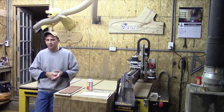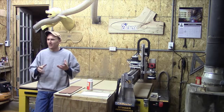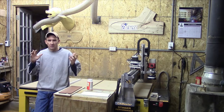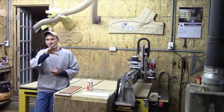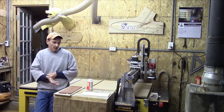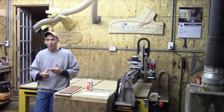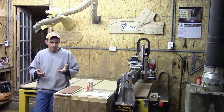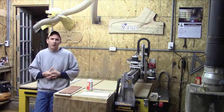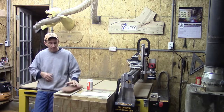The programs I've cut for you — we're going to give you samples — were basically in the holiday Christmas package and the holiday ornaments. There are 8 ornaments nested on one piece of material. I've drawn a single ornament out of that entire nested sheet, one at a time. The job requires two mills: you need a quarter inch end mill and an eighth inch end mill. Everybody's got a quarter inch up cut or down cut kicking around their shop, and your eighth inch mills — especially any of you guys doing cribbage boards. Two bits, scrap material, planed down thin.